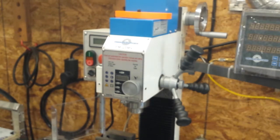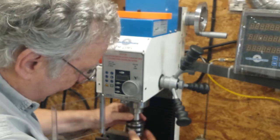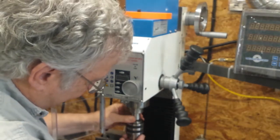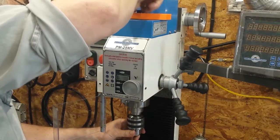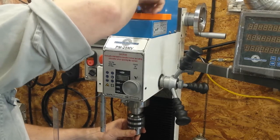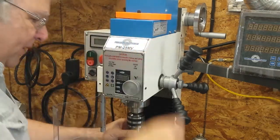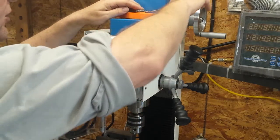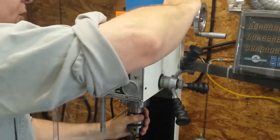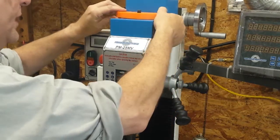To insert the tool you'd reverse the process — find your set screw. Spin it up as much as you can by hand, and you'll find it takes a little bit of practice, but you will reach a point where you can't conveniently turn it by hand. Then flip the tool to tighten. Pull the draw bar tight and then remove the spindle lock.